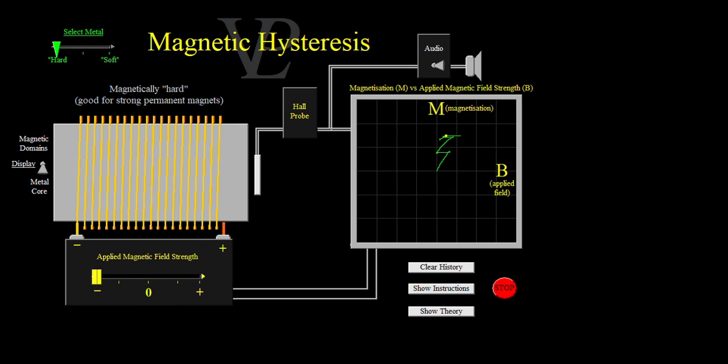And of course, we want the soft iron core in there so that we add its magnetic field to the field around the primary coil. So there is a stronger magnetic field going through the secondary, which means there is a bigger rate of change of the field through the secondary, a bigger rate of change of flux linkage through the secondary, and therefore a larger induced voltage, potential difference, EMF. So that's what it's there for. And one of the energy losses in a transformer is this hysteresis. You can't get rid of it entirely, but you can minimize it.